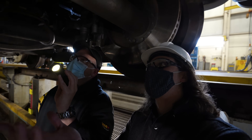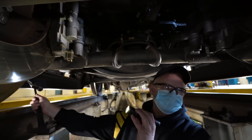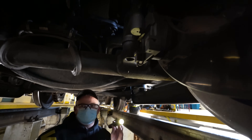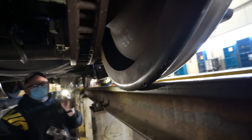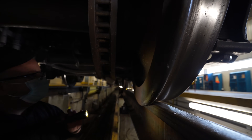Just like a car, a train uses disc brakes? That's right. Some cars have disc brakes and some have tread brakes. While we're under here, we generally check the wheel condition on the tread and on the flange itself to see that there are no condemning defects on the wheel.